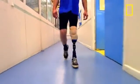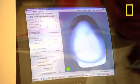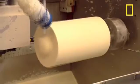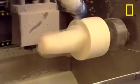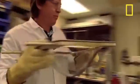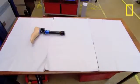Finally, the socket has to be manufactured — the bit that connects all this high-tech wizardry to the patient. The hospital simply provides a digital map of the stump, from which a foam cast can be produced. A hot plastic film is then draped over it and vacuum packed against the contours. A perfect fit every time.